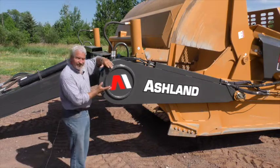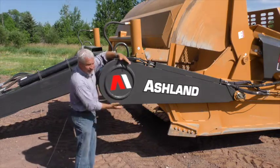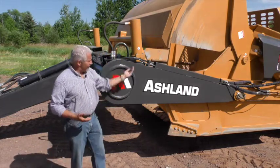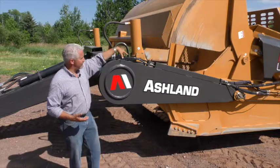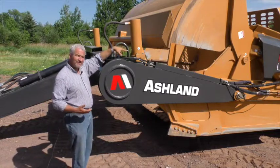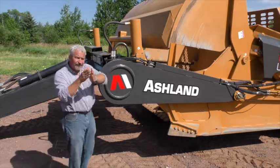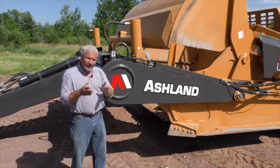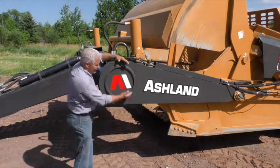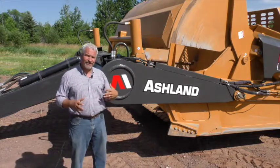This 16-inch diameter front section pipe uses high-strength material. We come up with a 22-inch wrap here for good vertical depth of this transition. The trunnion mount block has a spacer with solid plate for the cylinder mounts, giving us six and a quarter inches of horizontal depth and 22 inches of vertical depth to this area. We've got good stress control throughout this front section.